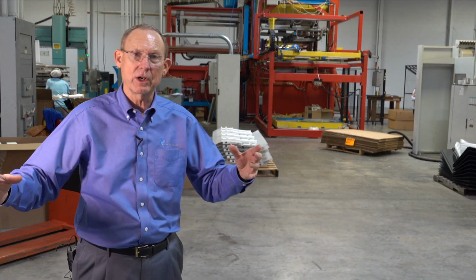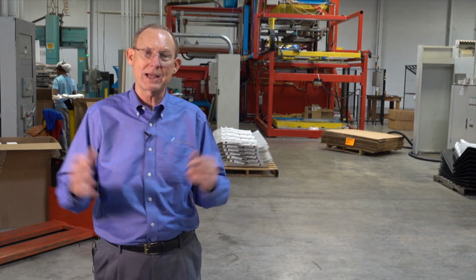So when you're doing a very shallow draw part, it's very difficult to do because the piece stretches out and now you've got to contain it in a very shallow draw part. With the zero sag machine, there's no sag at all. Well, when we pull the sag out of the material, there's less chance of thinning. We keep a much more consistent wall thickness on the plastic part.